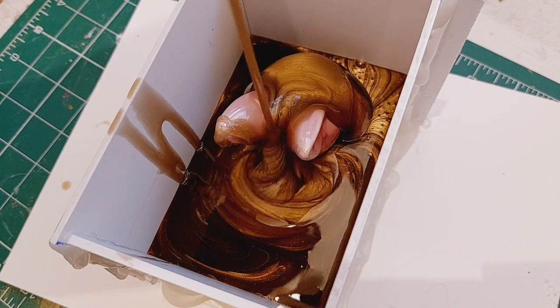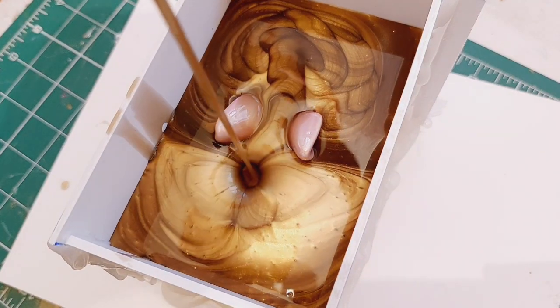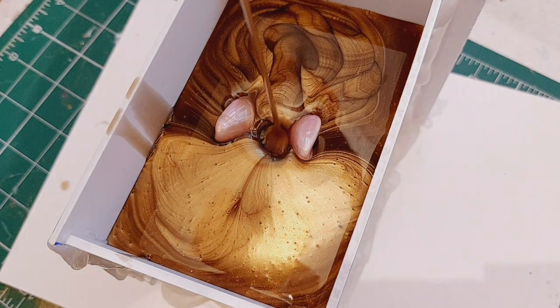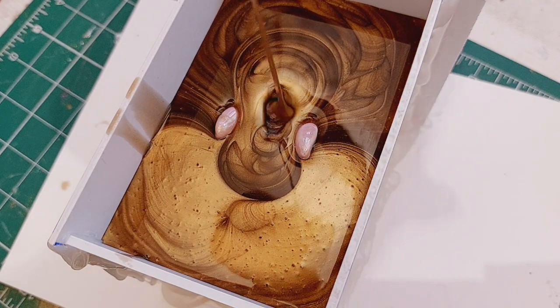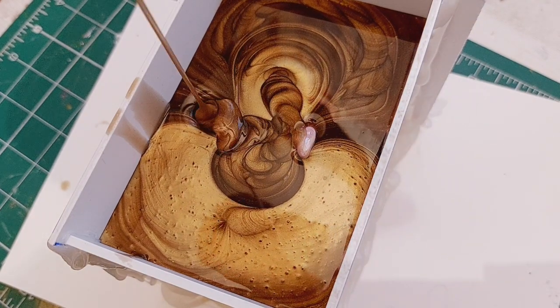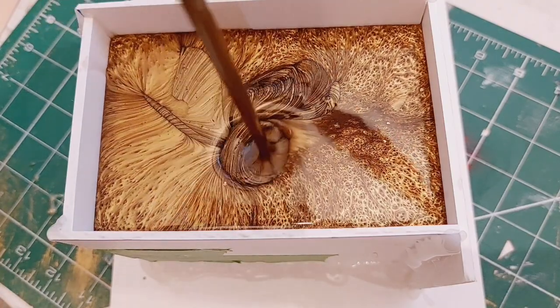Okay, to pour the silicone after mixing for 5 minutes, we are going to pour it from real high up. This is going to naturally pop bubbles, eliminate bubbles, and it really does help. So I am holding my jug of silicone around 2 feet off the desk, real high.